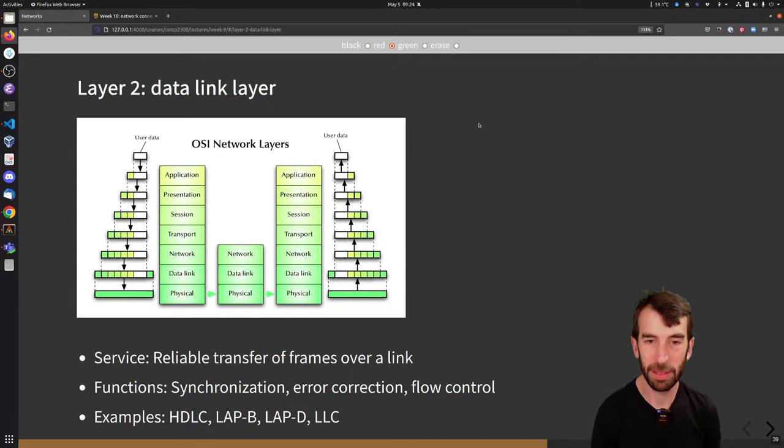What's a frame? Well, I'll tell you, last time we learned what a frame was in asynchronous serial, didn't we? We start with a start bit, that's where you have a falling edge. Then you've got your frame of bits, 1, 2, 3, 4, 5, 6, 7, 8. And you've got your 8 bits there. Start. And then you've got your stop bit at the end. Stop. That's one frame.